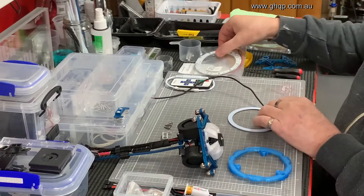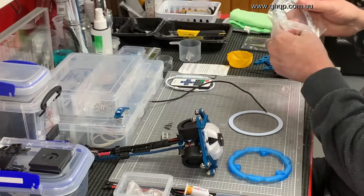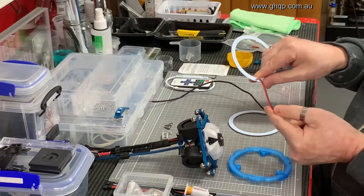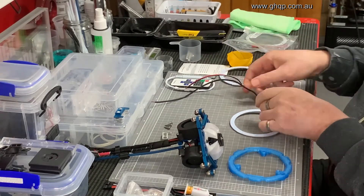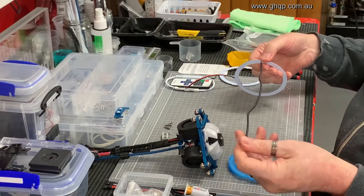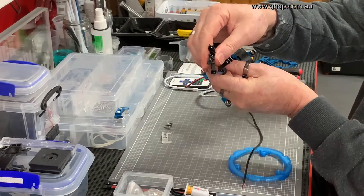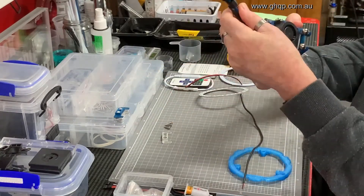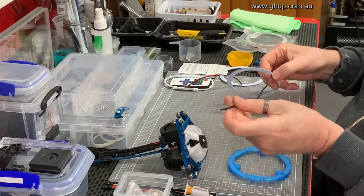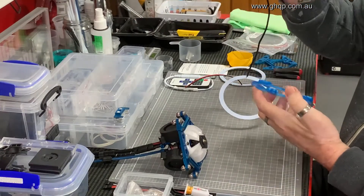When you buy the halo light they usually come with a very short cable, so I unsoldered that and soldered on an appropriately longer piece of cable to match the plug positions when the effector is plugged into the predator. I haven't terminated that yet because in order to secure this into the 3D print it has a hole and the plug won't go into it.